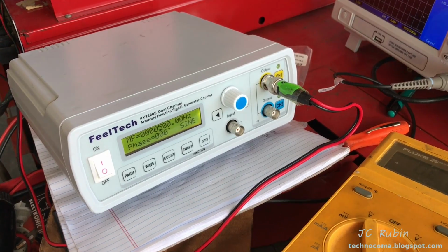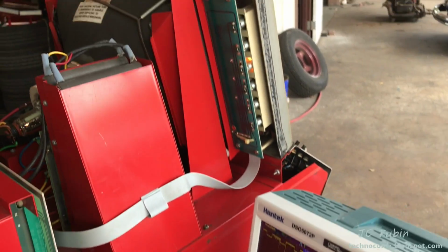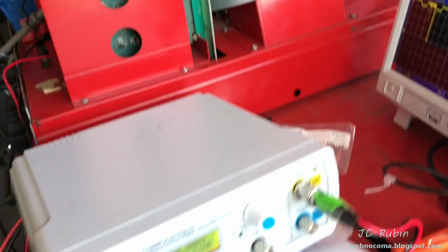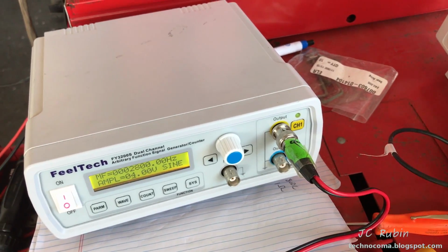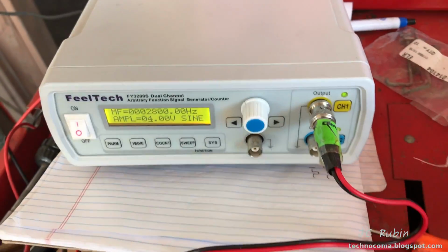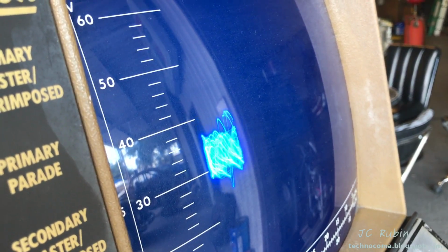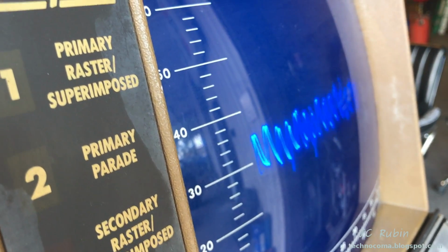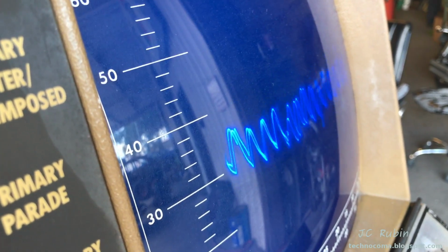Changing all sorts of timing schemes and parameters and pulses on this 555 is having absolutely no effect on the secondary. It makes me wonder again if this is part of another auxiliary function. It's time to take a look. Sure enough, this 555 again operates in support of an entirely different function. Another dead end. I'll display, and as I change settings, we can see the timing gets skewed. Different function, another dead end. So that's not the trace I'm going to follow. I'll follow the other trace.